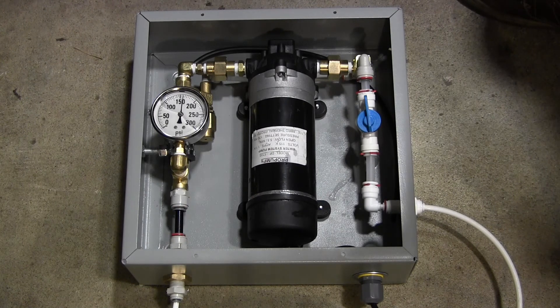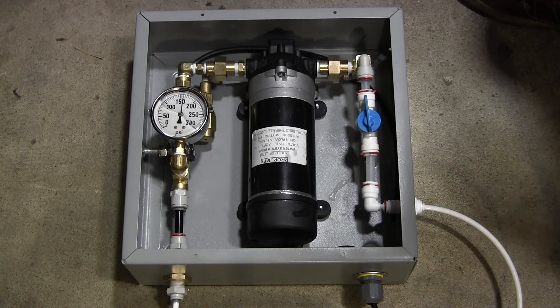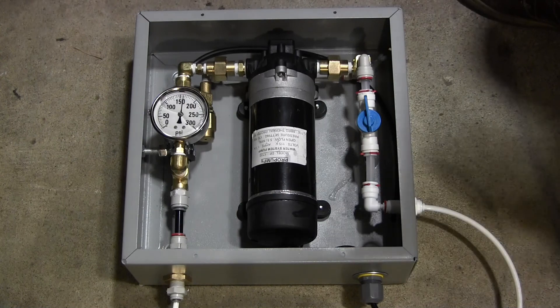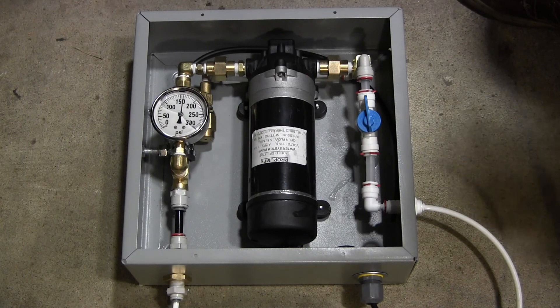That's a nice little pump package — it does the job. It'll do six, eight, or ten nozzles depending on the size. Won't do much more than that. It can get up to 200 PSI at full speed, and you can crank the regulating valve up to 250 PSI, but that's not recommended for long periods since the pump assembly is only rated for 170 PSI. The motor has a full load amp draw of 1.1 amps, which is reached at about 150 PSI. That's it for this demo.